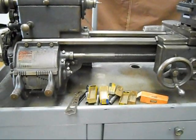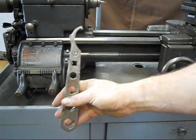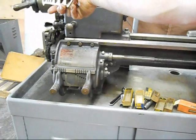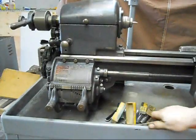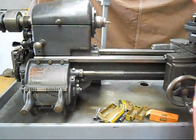That collet closer will come with the following. This is a wrench that's used for the special take-up nut on the back end of the spindle — that's coming with it. It's also got a spanner wrench. I'm going to shut the lathe off and show where these go.